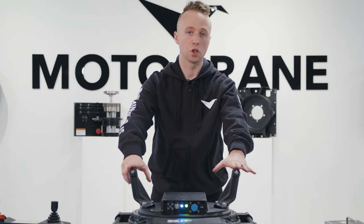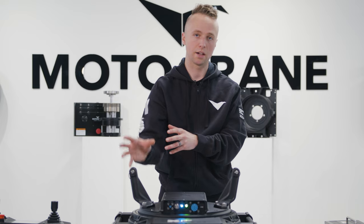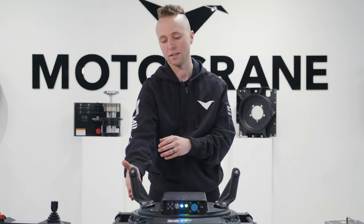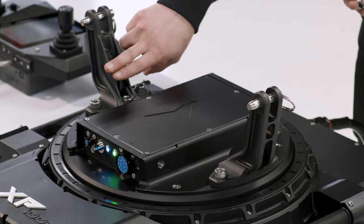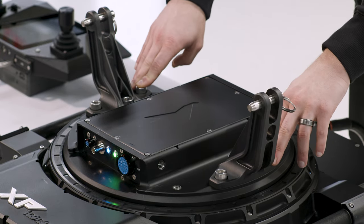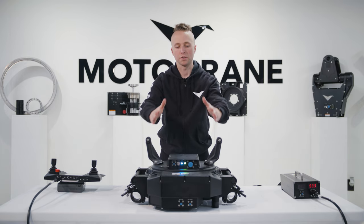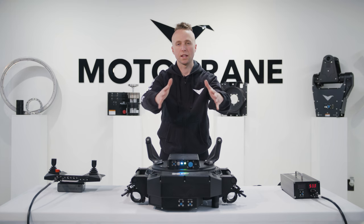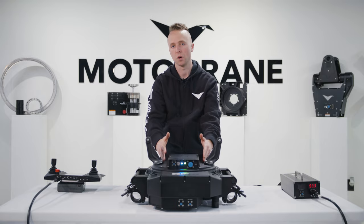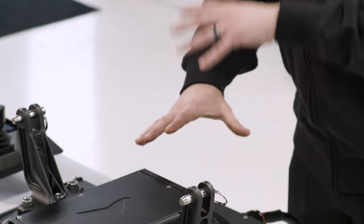In addition, we've also added these turret braces. These are the only exterior steel parts of the entire design — machined from 314 stainless steel and finished in black oxide, which contributes to them being insanely stiff. These are not aluminum; these are actually steel. They're fastened directly next to the inner race of the cross roller bearing. Once the Ultra turret gets mounted, turnbuckles are added to some included brackets, allowing the moment load of the Ultra turret to have a much more efficient path down into the rigidity of the cross roller bearing. So all of the flex you might have seen in an existing Ultra turret is completely gone.